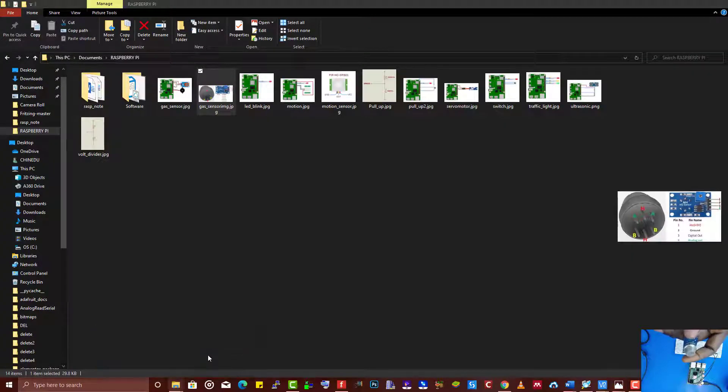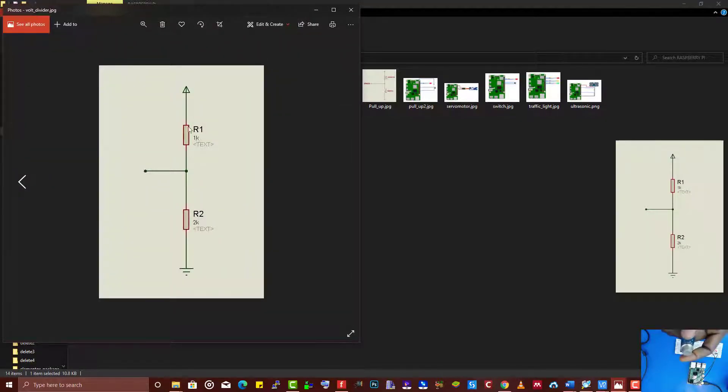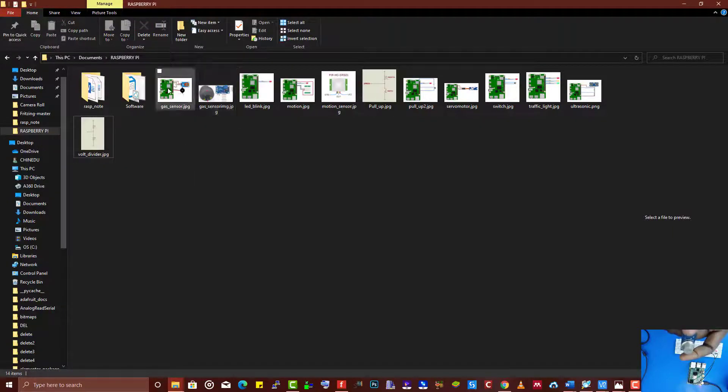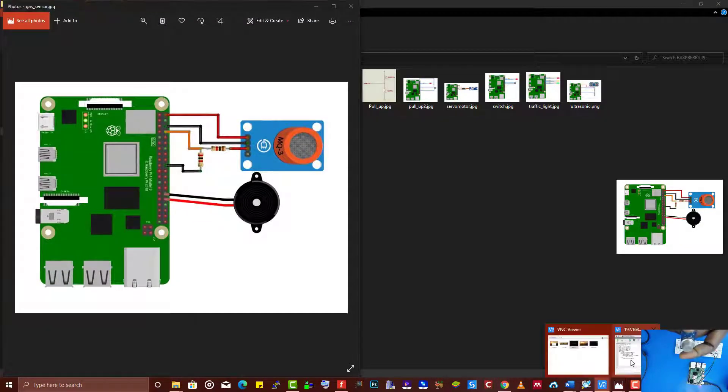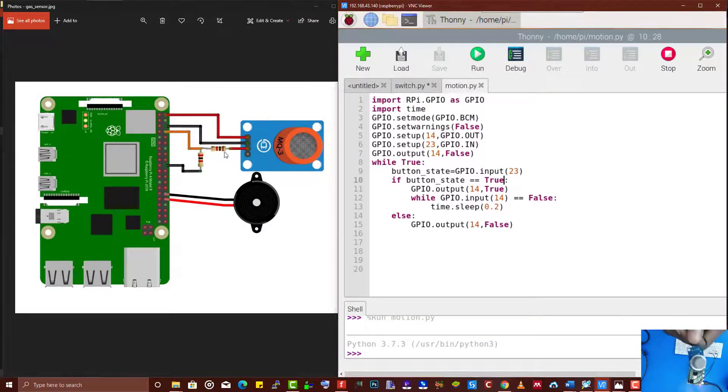When a gas is not being detected, these resistors are going to share the 5V that comes out. You have 1K here and 2K here. This is how the diagram looks realistically — the signal from the sensor goes here with respect to ground, then this junction goes to the Raspberry Pi. The resistor divider prevents any voltage above 3.3V from entering, dividing the voltage to an appreciable level.